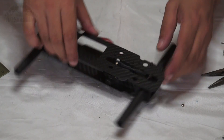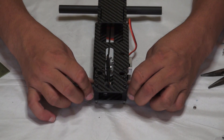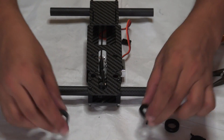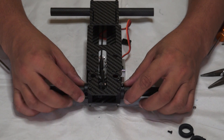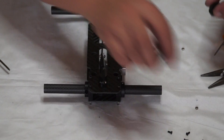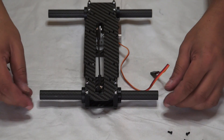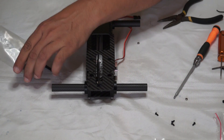Done perfectly - you can see if you align the arms right, our tilting mechanism is working! Now it's time to lock the arms. Slide the arms left and right, tilt them all the way until they lock forward and backward. Make sure nothing touches anywhere. Then we will slide these arm locks - the circular arm locks - on and lock them by tightening them with the provided screws, so the arm will not slide left and right during flight.